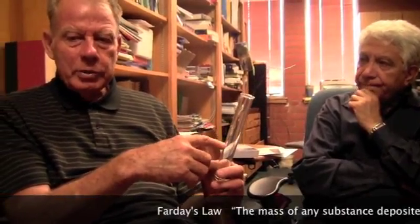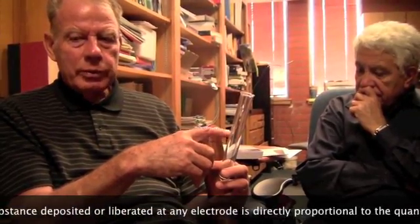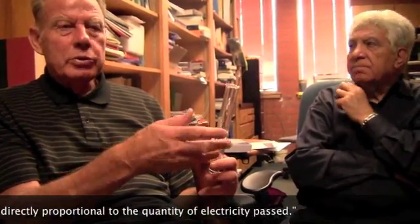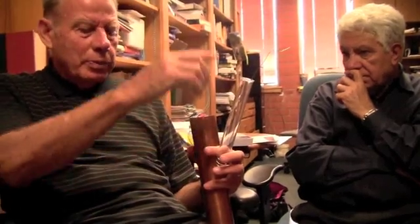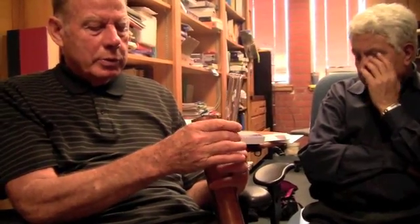That's just purely from Faraday's law, and it agrees pretty well with what I see. That's also how I rule out recombination — the amount of water electrolyzed is close to Faraday's law. I actually lose a little bit more water than Faraday's law predicts because some water is carried out as vapor by the gases bubbling up. You can calculate that theoretically — it's about 4%. If you start with 100 grams of water, maybe 4 extra grams came out due to vapor.